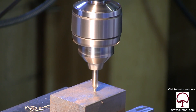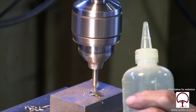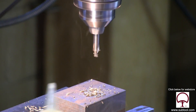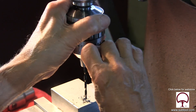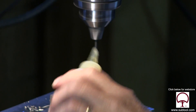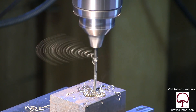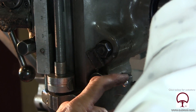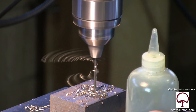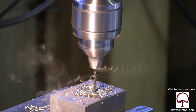We've got our center drill in there. It looks like it's going backwards, but it's not. We just cranked up the speed a little bit, put a little cutting oil on there. Here's our pilot drill. We'll crank up the speed just a bit and go in there and punch a hole all the way through. We're going to go all the way through with this hole. I put a little bit of tension on the spindle because the spindle on this machine tends to be just a bit loose.